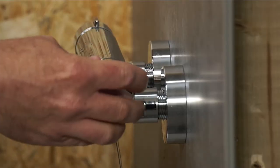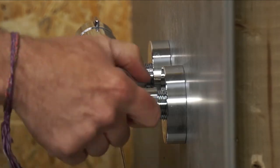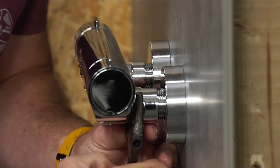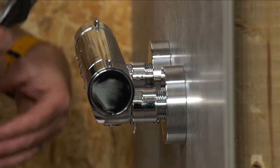Just do that — we're just releasing the pressure out of this pipework here. Make sure we do that first, then we can turn this back off. What we're going to do is slacken off these two nuts at the back — grab yourself an adjustable. Just get that in the back like that and then just slacken that off until it goes nice and loose, hand tight like that.